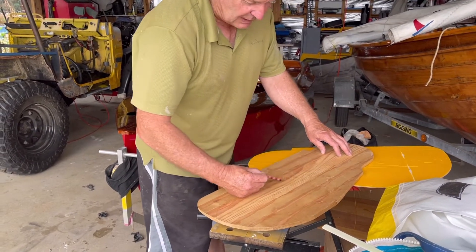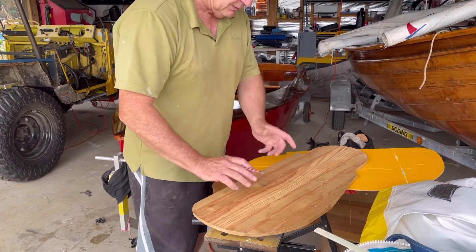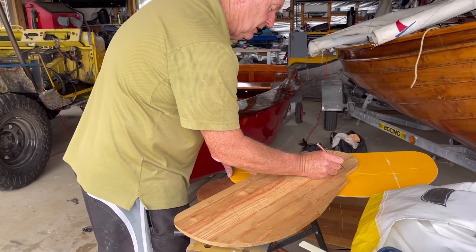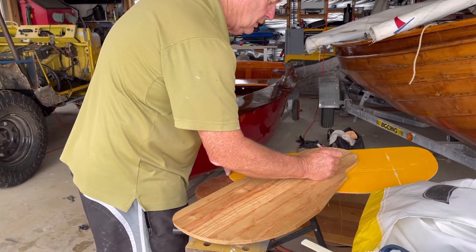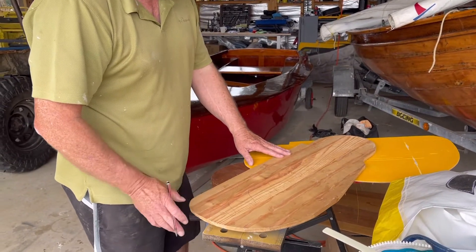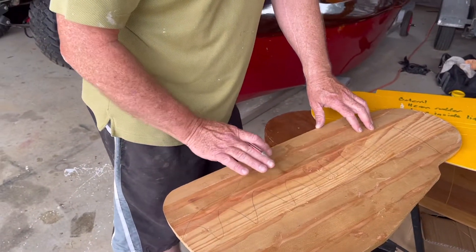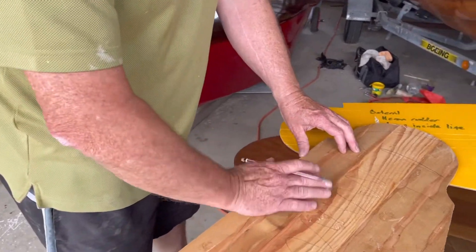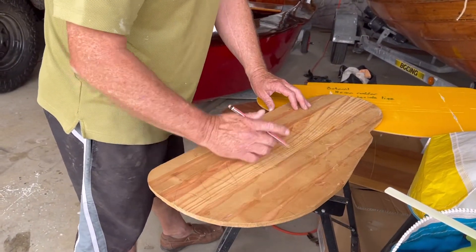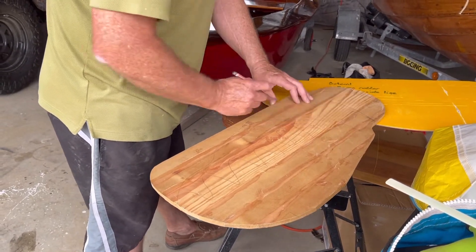The point of maximum thickness is mainly through where the Oregon is, and then it's tailing off — a bit thicker there. You've seen aircraft wings of course — you want the aerofoil shape, and that's essentially what you're looking for here. You want a part that's flat through the middle, then a more abrupt shaping curve to the front — the leading edge — and then a slow taper out through there in that aerofoil kind of shape, as I've drawn on either side.